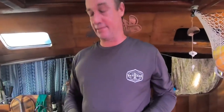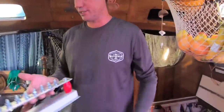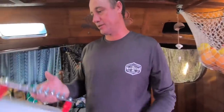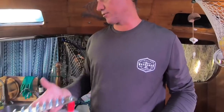These bus bars are just from our standard wholesaler. They were about $50 — all tin copper. Three or four times cheaper than going through a marine chandlery. We're trying to budget but do it properly, and that's by far a nice heavy connection. Probably overdone — the bus bar size probably only needs to be this big — but the price difference makes it so cheap for all these materials.